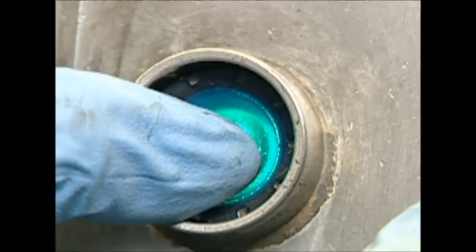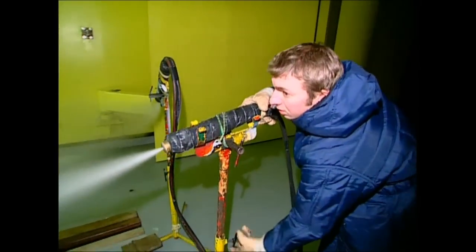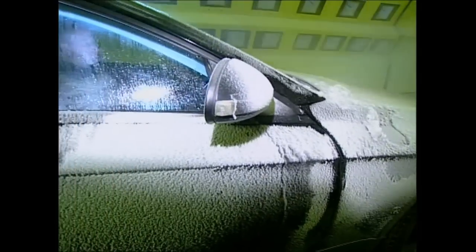To make sure the rubber quality is high, samples are taken from each batch and run through rigorous tests. Dirty water is sprayed on a mock windscreen and the wiper's ability to clear it is monitored. In another test, a nozzle blasts snow at the car in a wind tunnel at minus 30 degrees Celsius — each wiper has to survive 24 hours in these conditions non-stop. If they can't clear the snow or they jam for any reason, they fail.